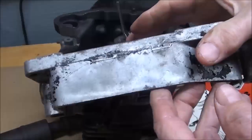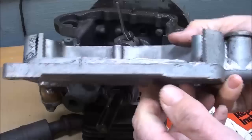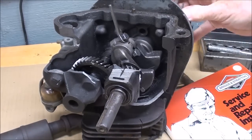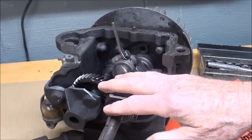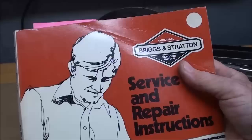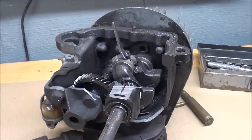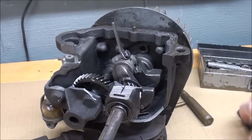You can see the evolution of these Briggs engines — this one is probably from the late 40s or early 50s. We have an aluminum bottom die-cast, a zinc flywheel, and we're still a long way from a fully aluminum-made engine, so this is very heavy for probably a one-horse engine. It's nice to have a Briggs book because that will have your torque specs as well as your bearing clearance specs. Briggs used to donate these to the school by the case.